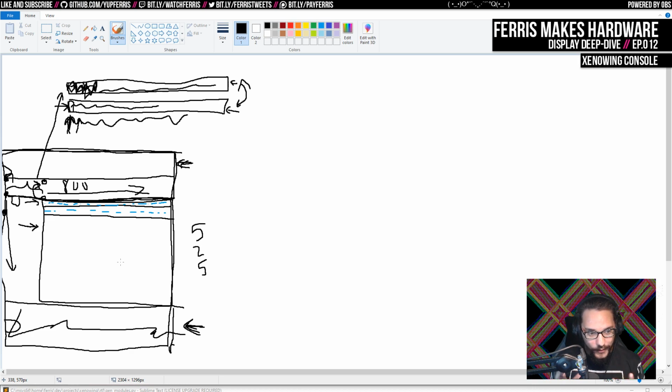So I'm going to give that priority over the CPU as well, because the CPU is mainly going to be driving that. And then the CPU has the lowest priority. But it's essentially that kind of priority. That's all it really does. If there are any requests from the display or the GPU, then whatever units are above that just get blocked out. So it's just a couple of muxes in terms of that priority encoding.